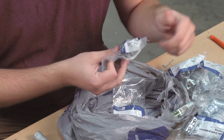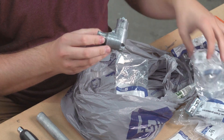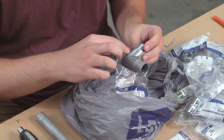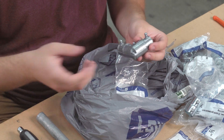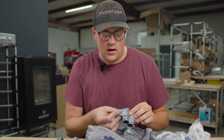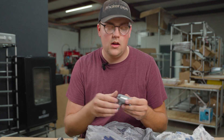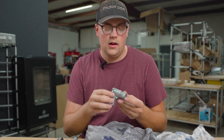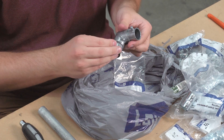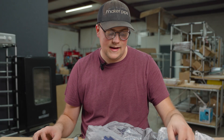Getting close to the end — this is an EMT to box pull elbow. This is a pull elbow, very similar to the pull-through box we looked at earlier. You can take off the outside of this elbow and use it to pull cables through, just like with that box. This is a sleek 90-degree connector used for smaller bundles of wires. You take off that panel, pull the cables through and route them through the 90-degree turn, then put the access panel back on the outside. It also has set screws to secure the conduit in place in the corner.